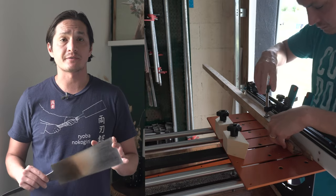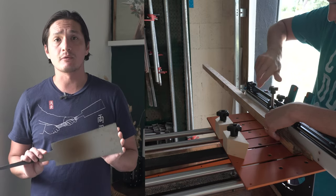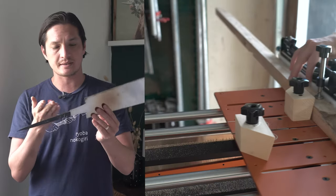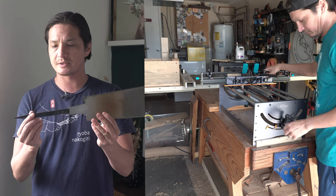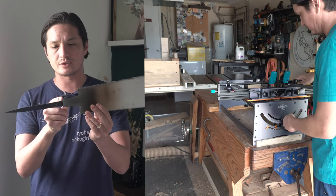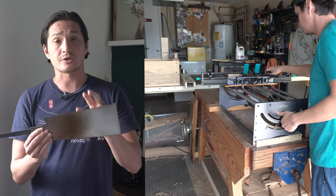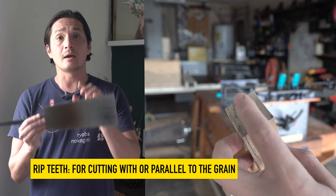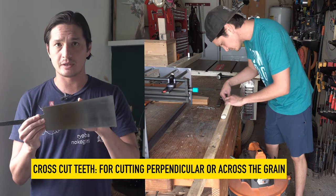While we're doing a little bit of the boring stuff as far as dimensioning a stick to use for this handle, let's go over the anatomy of a Japanese Ryoba. This is a non-disposable Ryoba. We have our tang that is embedded into the handle, our neck which is shouldered and will butt up against the handle, and then our saw plate. Our saw has rip teeth — a lower tooth per inch count — and cross-cut teeth on the other side, which is a higher tooth per inch count.